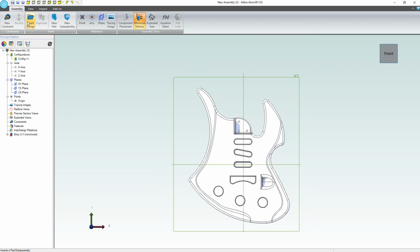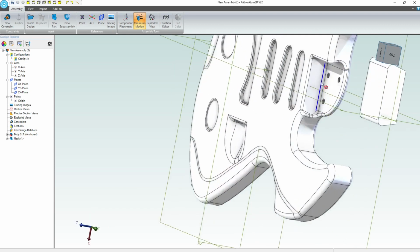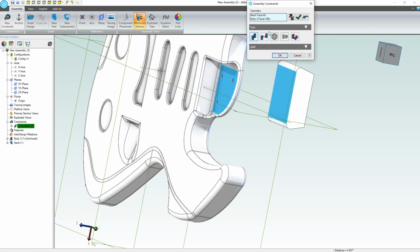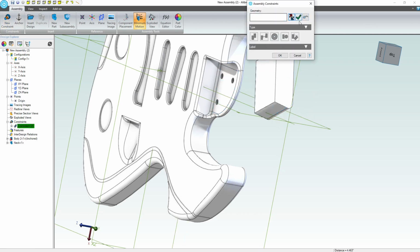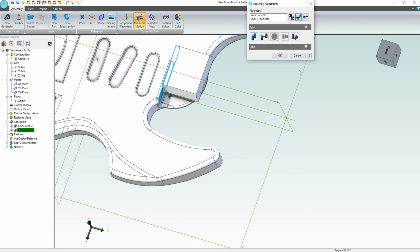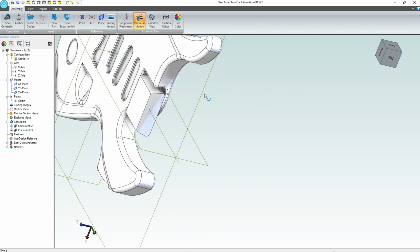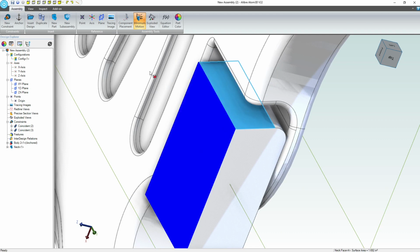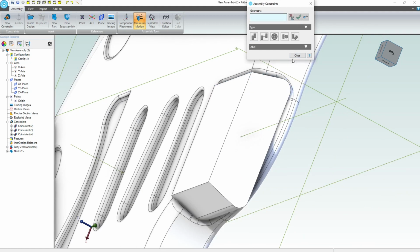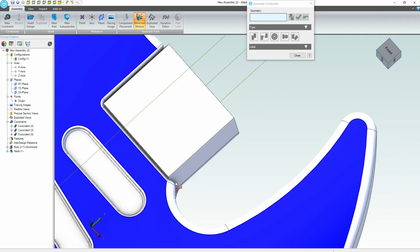So next let's insert our neck. And we'll finish that. So we want this to fit into our channel, so I'll choose this face and this face. Choose New Constraint, flip that around. Now I want this face to back up all the way against this face so they're flush. And then where along here, how do I want it to fit in? We'll say New Constraint on these faces. Now we have a little bit of interference in here, but I think we're going to clear that out pretty nicely if we just fillet it.